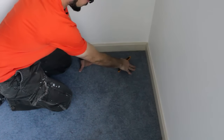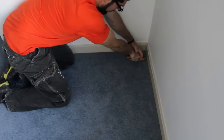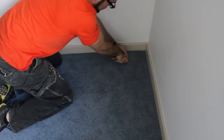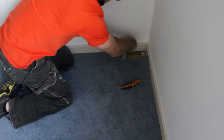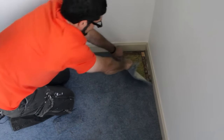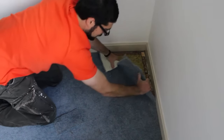What I like to do is start in a corner. If you can't pull up the carpet by hand — like right here, I can't pull this up by hand — what you can do is cut a little notch in the corner. That notch allows you to grab it with your hands, and then you can simply pull back using both hands. The carpet is going to be attached to these tack strips, and that's no problem. The carpet will just come right off the tack strips when you pull.